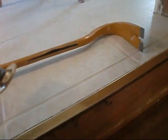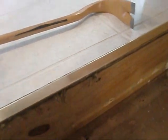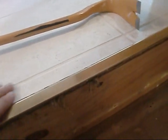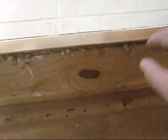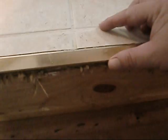My multi-master here with this grout cutting blade on it to cut it out here, right through here, and get this Schluter out and get me down far enough. What I'm going to do is, I ran it past my brother, I'm going to cut the bullnose part of an extra tread I have to fit right here as a threshold. All right, keep training, bro.